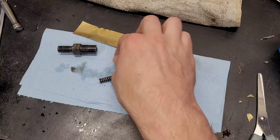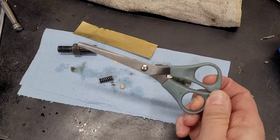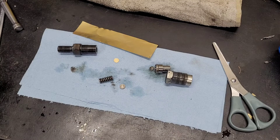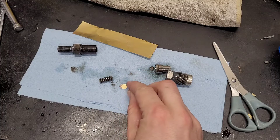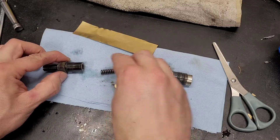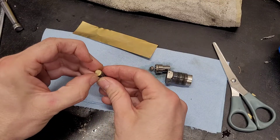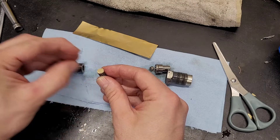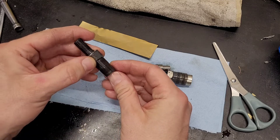What I did was just cut out a little circle that matched the stock shim using some cheap scissors — make sure they're not serrated because that'll mark up the edge. I traced it out and cut my little disc. That goes on top of the stock shim, back on the spring, and we'll reassemble it.